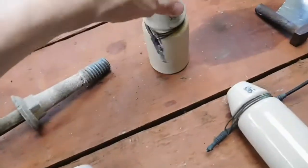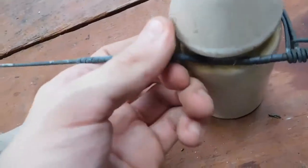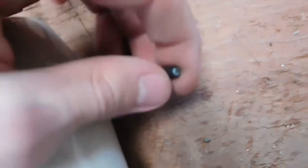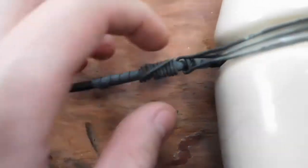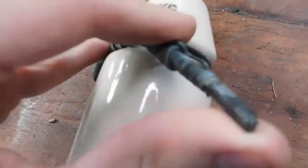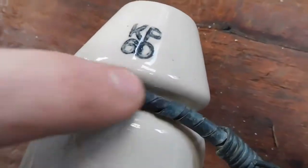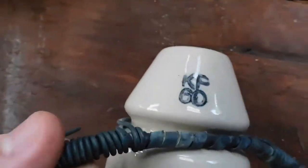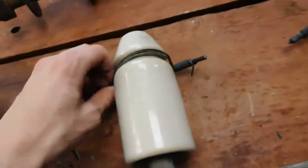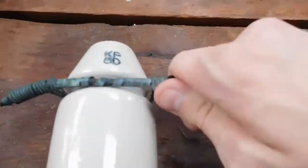There are a few subtle differences between these ones and the newer ones I've got. These actually have insulated copper wire, while on these it's just the bare wire bound straight onto the insulator. These have got what feels like a plastic or maybe even a rubber coating over the main transmission wire, then wire work holding it onto the groove. You've got the main wire going across, a flat copper strap wound around it, and then a thinner wire wrapped around that — and that holds the whole lot onto the groove of the insulator. Holding it for 60 to 70 odd years and not coming off is actually a very effective way of doing it, and somewhat flexible.